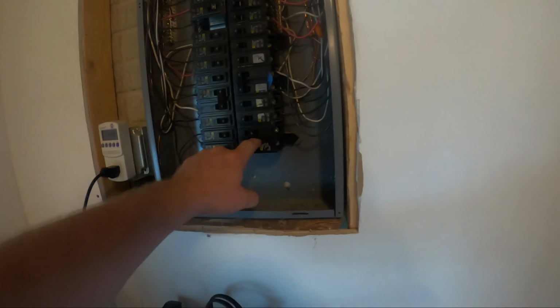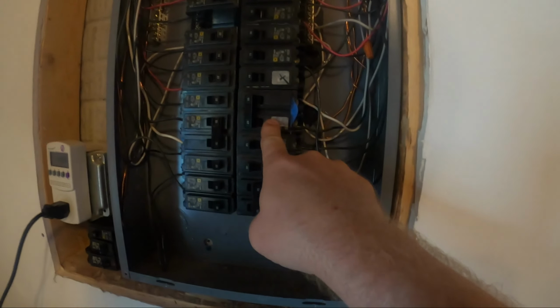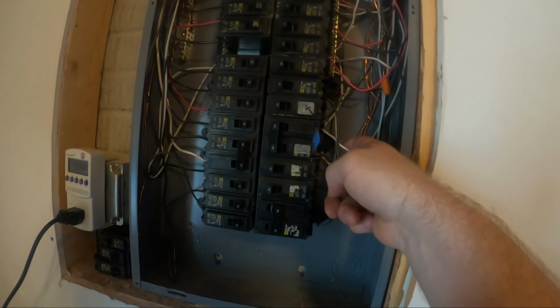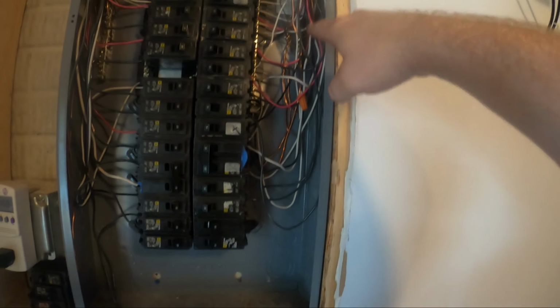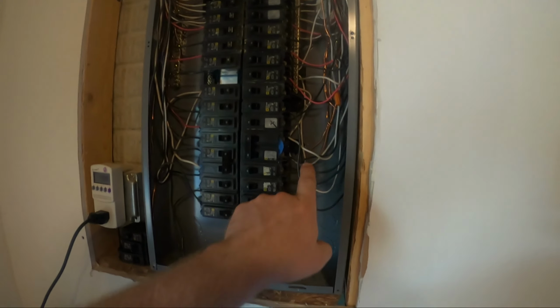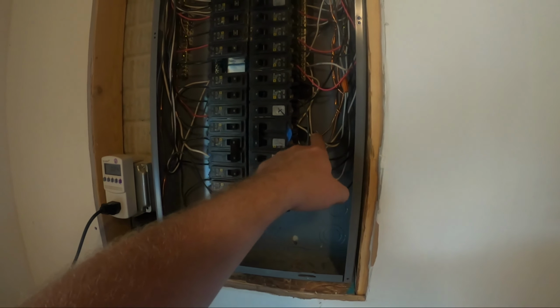But essentially, you'll run, like, see this 220 right here, whatever this is for, how they have the white and the black hooked in, and then the neutral is gonna, well, ground, whatever, protected earth will go on that bar with bare wire. Jackasses, this should have a piece of red tape around the end to signify that it's live and not neutral. Okie doke.